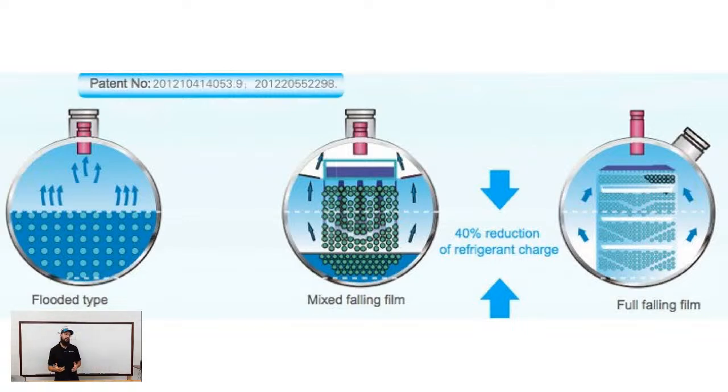That's a really bad condition, because these are vapor machines. Centrifugals move vapor. They don't do liquid, just like anything else. And honestly, you can get away sometimes with some liquid with a screw and a scroll. You're not going to get away with that with a centrifugal. And what that'll lead to is